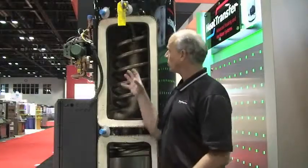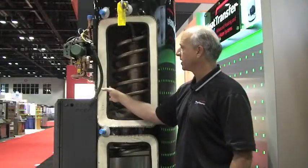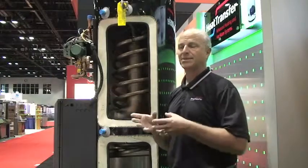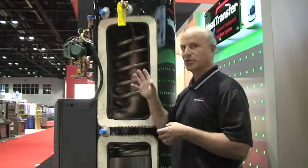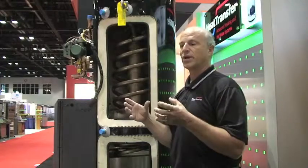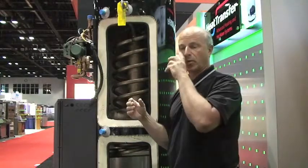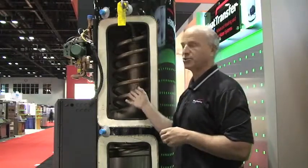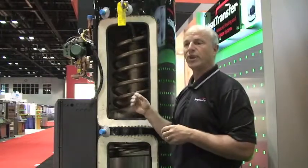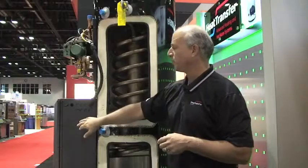Modulation is really critical in the design of this system because what it does is it balances your loads. This tank is an integrated tank where we're doing two jobs, and what we're trying to do is manage that. And the way you manage it, just giving the amount of input and making your heat exchanger more efficient, is you basically have a modulating input burner.